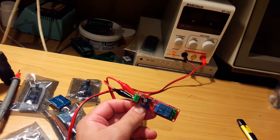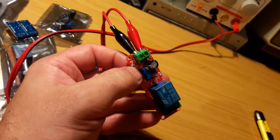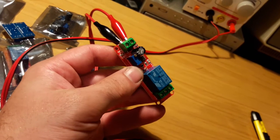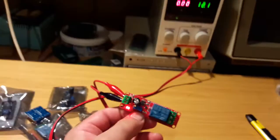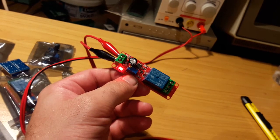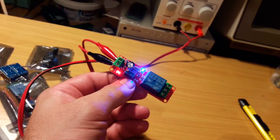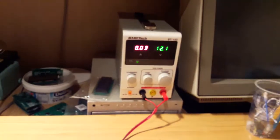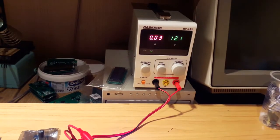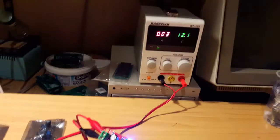Some bonus footage — I couldn't resist. I cranked up the little potentiometer; I think this is the maximum resistance it can give, and also maximum delay. Let's turn this thing on. Click. And the relay coil draws about 40 milliamps, 35 milliamps at 12 volts.